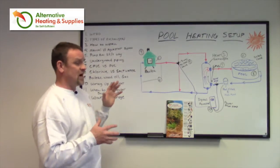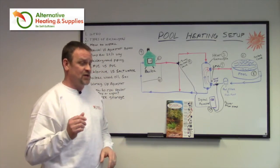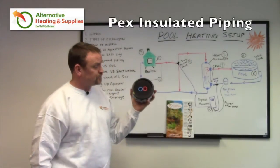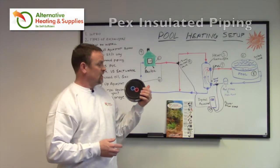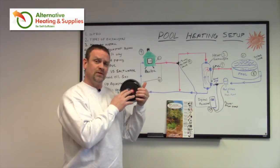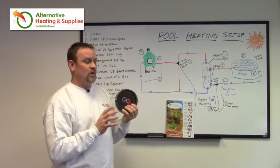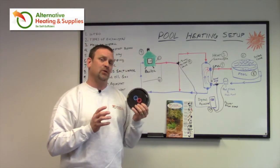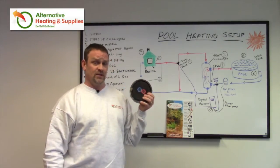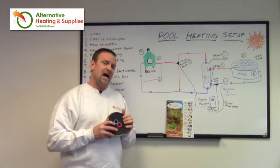So even if you don't have a wood boiler and you have a traditional inside heating boiler, you can hook this up to your swimming pool. You're basically going to run two PEX lines underground — an underground insulation system that comes from your house — and run a system that keeps the two pipes with your boiler water warm in the ground, sending it to a heat exchanger. In a traditional winter application, it's really important that we keep them very well insulated in the ground because it's freezing outside. In the summer when we're heating pools, heat loss in the ground is not as important.